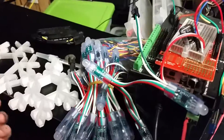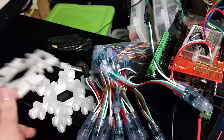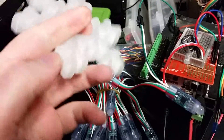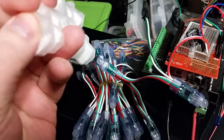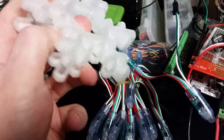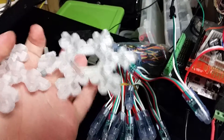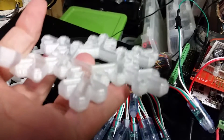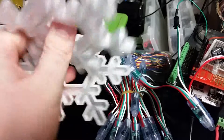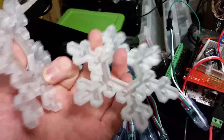Got some of my recent prints — definitely working on the snowflakes, big enough to fit LEDs in. I was impressed this thing actually fit properly the first time. That was a quick bit of work in SolidWorks to give this thing a mating lip on one side to fit into the interior of the other shell, and it's got enough space to fit five-millimeter LEDs or piranhas — they both fit in those channels, so those would be fun.